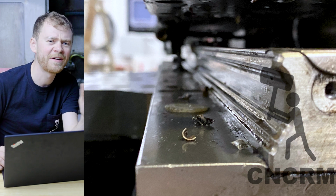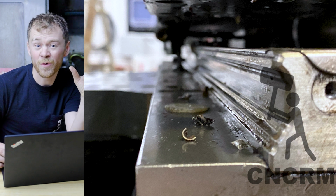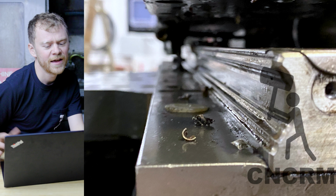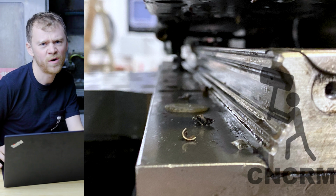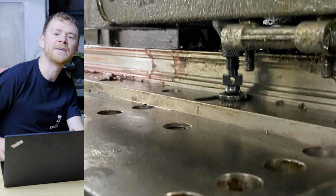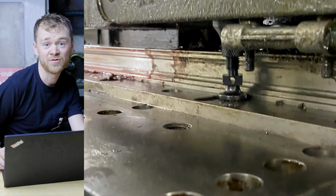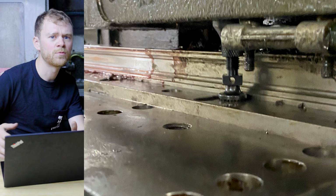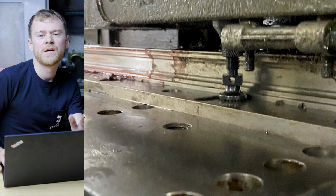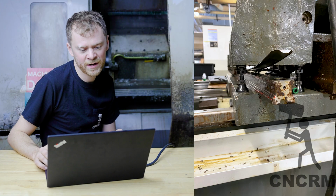The forklifts and crane situation was not great here, so I did everything without taking the wedge out. Probably should have, could have, I didn't. I didn't want to try to deal with it. So I ended up using machinist jacks to lift the wedge up and replace the rails and the trucks underneath the wedge, which sit on the plate for Z axis. So it's the plate for Y. It wasn't terrible. There are through hole bolts everywhere to get to everything.